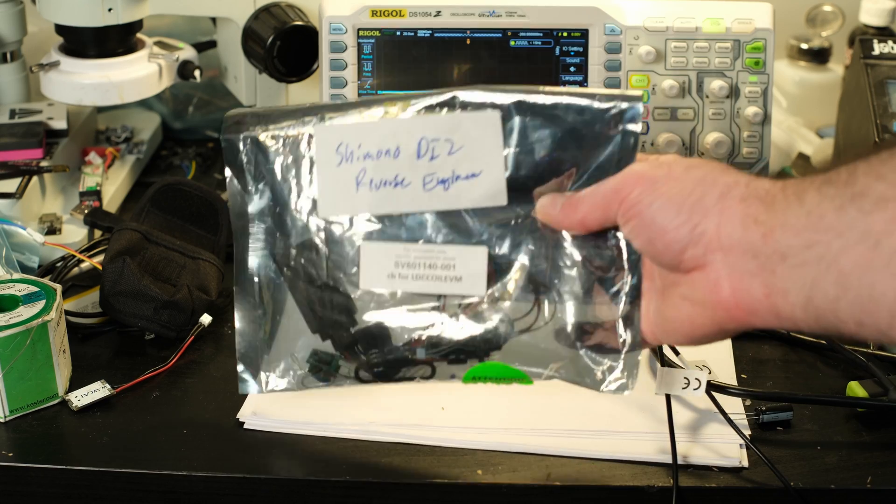I tried every combination of inductors, common-mode chokes, and large capacitors, and it still didn't work. Basically, you can't capacitively couple CAN or RS-485 to power lines that are actually carrying any current or even a high enough voltage — it just doesn't work. The on-off keying modem had a real strength here because I was using an 8 MHz carrier, switching on and off really fast, inducing decaying bursts onto the line and detecting them. With differential signaling, if you want one line high and the other low, they decay because they're capacitively coupled, and if they get too close you won't get a good differential signal.